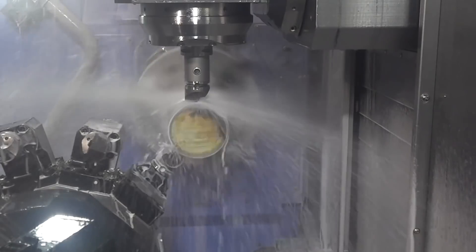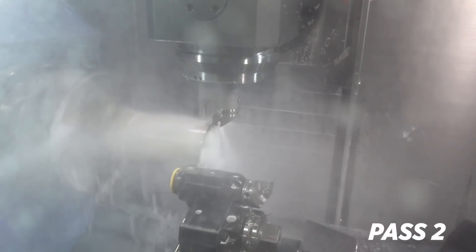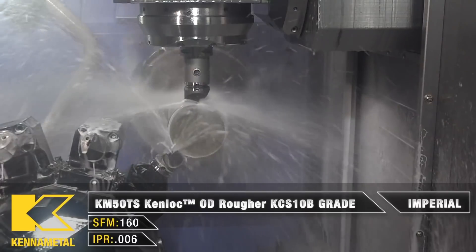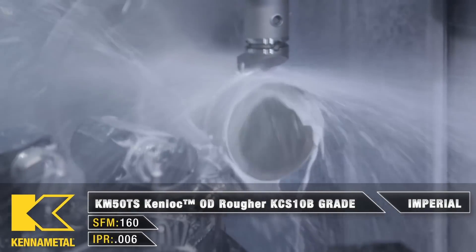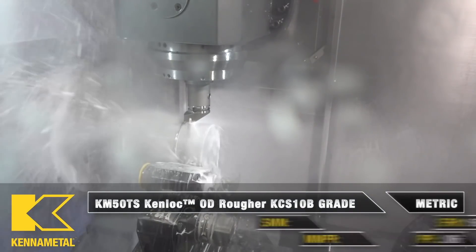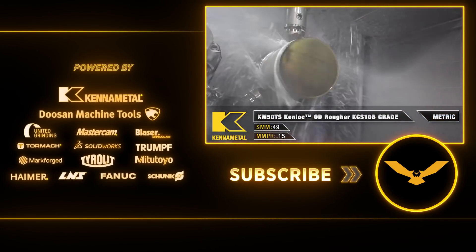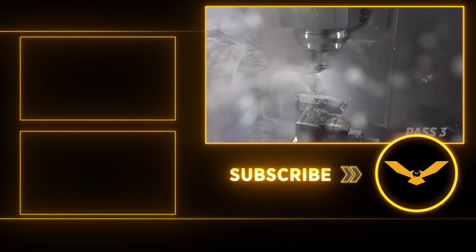The key takeaway here is that slowing the feed is not always the answer. Instead of guessing what the feed rate should be, do the calculations and see what the thickness of the chip that you are producing is, and always keep that chip thickness in mind. This is a more accurate representation of what feed rate will work, say if you decide to use a different tool that may have more or less flutes, because just memorizing the speed and feed isn't going to carry over to another machining application like it will if you simply know what chip thickness works well.